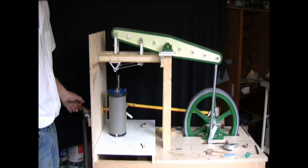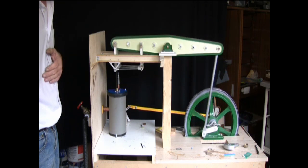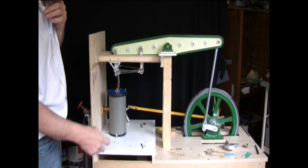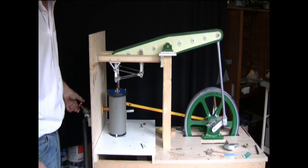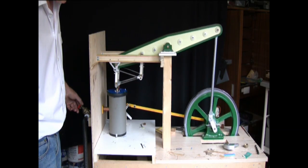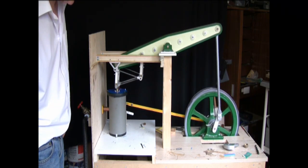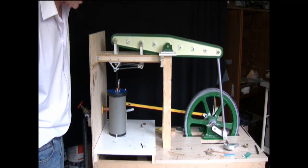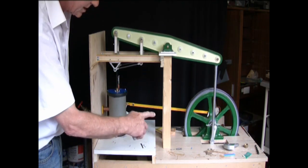Just a piece of plastic for the cylinder head at the moment, crudely sealed with masking tape. So having built it with normal hand tools and just a cheap small drill stand from Machine Mart — I have got a large band saw, but cutting the flywheel out could easily be done with other hand tools. Just turning her down a little bit more to see how slow we can get her to go. Just about stalling on top dead centre — perhaps I could open the valve a little bit earlier. She seems to go through bottom dead centre very nicely.